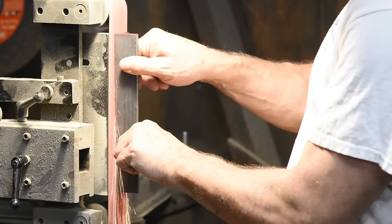Now I'll tap these using a straight flute hand tap. Tapping can be very frustrating. If you have any better way of tapping than what I'm showing right here, absolutely do it that way — this is by far the worst way of tapping anything; I'm just showing it to show that it can be done. The more you can do to assure the tap enters nice and straight, the better. Here's one hint: always buy two taps and two drills. Why? Because if you only have one tap, modern science has shown there's an 87% chance you'll break it — and then you're driving to freaking Home Depot again.